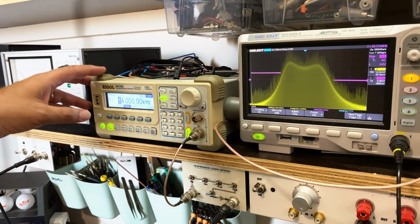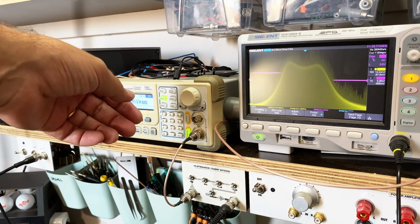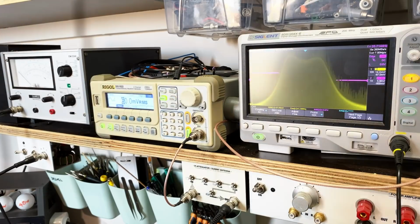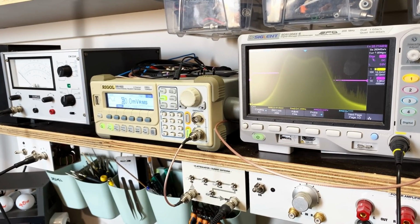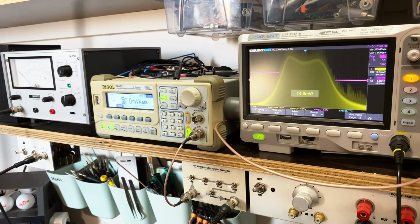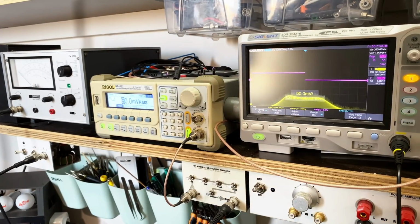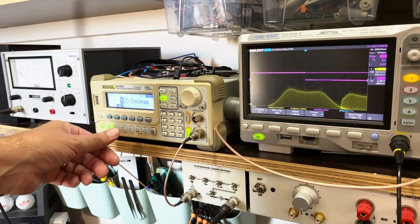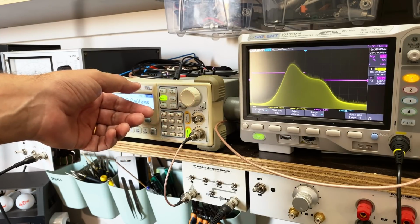Now this part leaves me a little bit nervous because what it's telling us to do is to increase this by tenfold, 500 millivolts. Jeez. Well, I've just checked the German version of the instructions and it definitely says 500 millivolts. So I'm going to make that a lot smaller. Make sure this thing is well grounded. Let's try 100 millivolts. Well, 200, 300, 400, 500. Nothing's exploded.